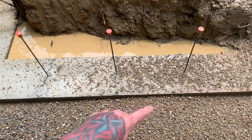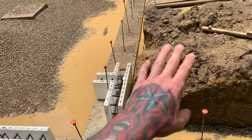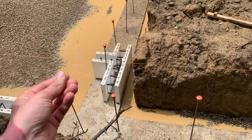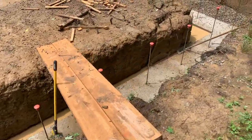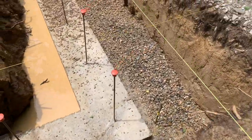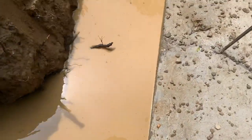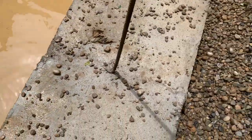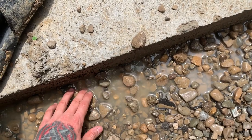The 57 washed round is going to go all around in here. You can see that where it's been raining, all of this clay has settled — this silt and clay, very fine particles within the water. You want to keep that out of the French drain. If you look, you've got very nasty silty water right here, but where I've already started laying 57, you can see that this water actually goes down a few inches in some spots.